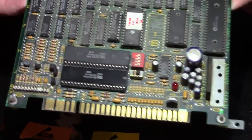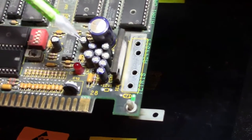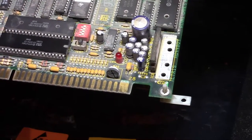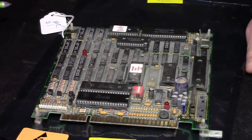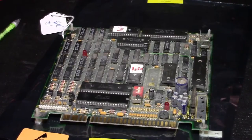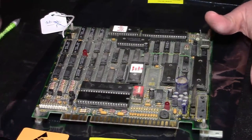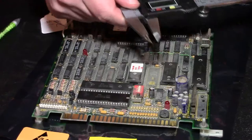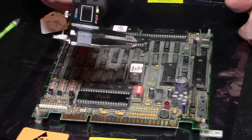They are very crammed in there. If you can see, they're very close together here. You're not working with much space there, so it's very important that we get the smallest size possible for these capacitor values. What he told me to do was to actually measure the diameter of the different capacitors here so that when he checks his inventory, he can see if he has caps that are going to fit. So what I've got here today is a set of calipers that measure in millimeters. We're basically going to measure a few of these capacitors and then send that order off to Ian Kellogg.